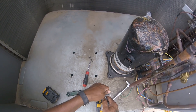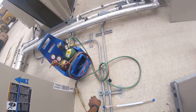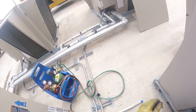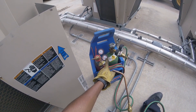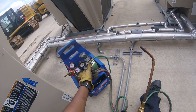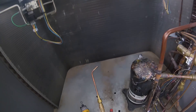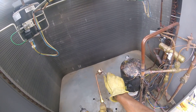Got that crank heater out the way. I always put my acetylene in at about 10, between 10 and 12, and my oxygen on 20. To manipulate that, you got to use this dial to turn to 20 psi — that usually works for me. Use a rosebud so I can get the job done. If it's a rosebud, it means a big tip.